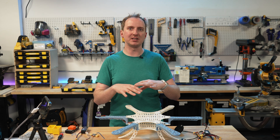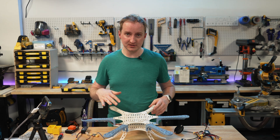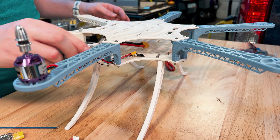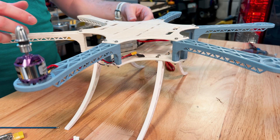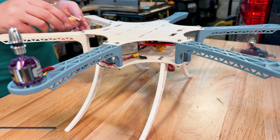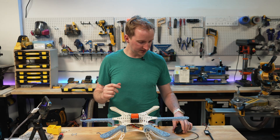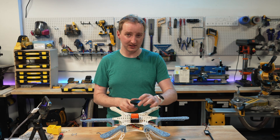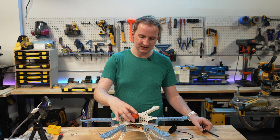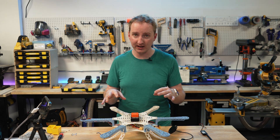I'm not going to sit here and video myself doing all of this — it's going to take a while. I'm going to attach the other five motors around the outside and wire them the same way. The bigger batteries are going to go in the center layer, all the main power distribution cabling will go in there as well, along with the little power regulator for the flight controller. Then I will attach the flight controller, attach the GPS — probably on a little stand to make it higher — and I'll have an RC and telemetry controller there as well, then just plug the servos in. It's not terribly complicated.